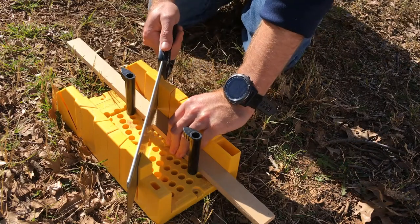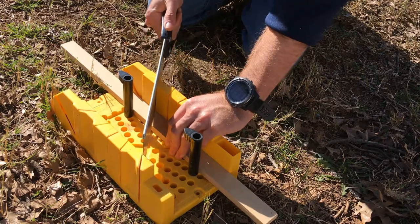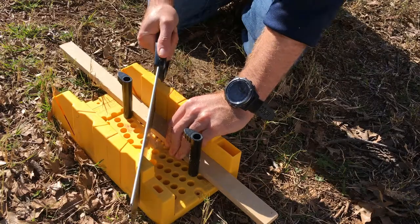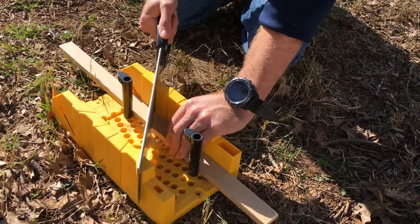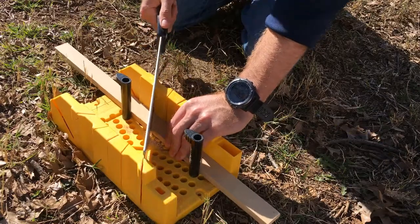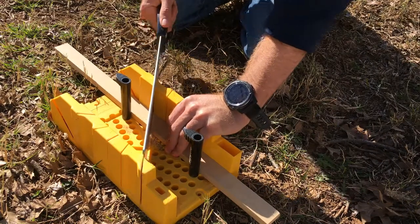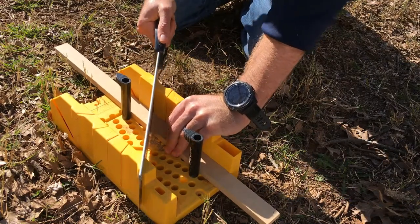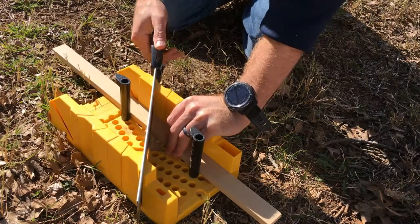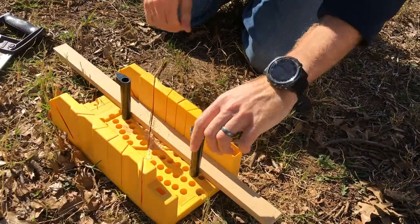Usually it's just a long, slow, rocking motion — rocking forward and back. There's a fair amount of dust from the MDF but it doesn't take a lot of pressure; just let the saw do the work as it runs through the guide. Continue to make that cut — really easy, not a lot of effort. Once you hear the saw slide across the plastic at the bottom, you know you've finished the cut.